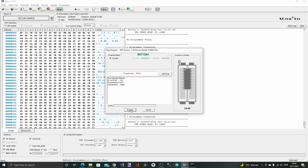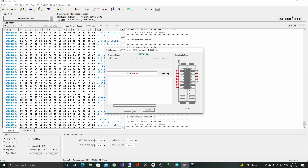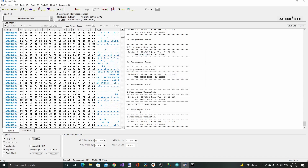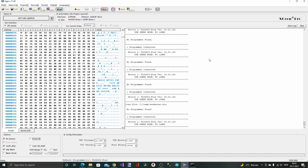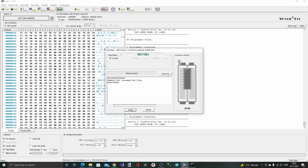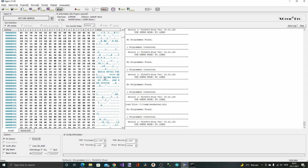It failed. I untick the 'check ID' option and try again — pin detect error. I take the chip out and re-insert it, and it still fails with a verify flash error. I try reading the chip instead — read successful. Looking at the data read back, it actually shows 'ARCTIC RETRO BASIC' correctly, so it seems the write did work despite the error message.